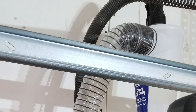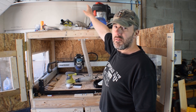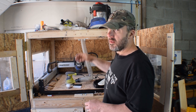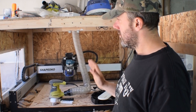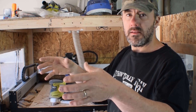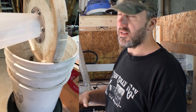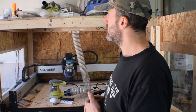I put a couple of zip ties on the top part of the hose so it doesn't pull down through. I attached the two-and-a-half inch hose to the side of the cyclone dust collector so it collects all the dust and chips inside the bucket, meaning I don't have to empty the vacuum as much. I plan on mounting the bucket and cyclone on the side of the CNC enclosure or to the wall for easy access, and I'm also going to get a gamma seal lid to make emptying the bucket much easier.